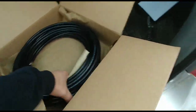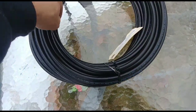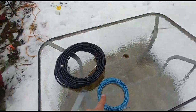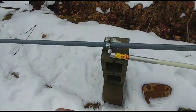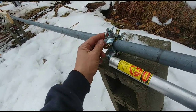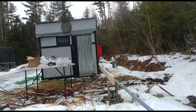There it is — 100 feet of high-quality UHF coax. I'm going to use dielectric grease in my connections outside. This is going to be the guy wire that holds this mount over here. I've got it kind of set up — I'm using the braided blue cable for connection points for safety, and then I have 100 feet of green wire that I'm going to attach from over here to right there.